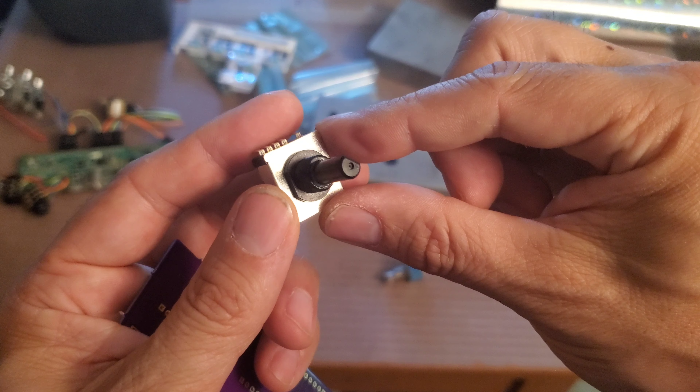What I wanted to do was look at the fit into the body. Spoiler alert: it doesn't fit exactly. It looks very close from here, but if you look along the board you can see it kind of creeps forward and by the end there's a little bit of space. Why did that happen? I measured with calipers and chose 0.7 inches as the perfect distance between pots after testing a lot of different distances, and that's how I laid these things out. You can see from one terminal to the next that's 0.7 — all the way to the big selector.